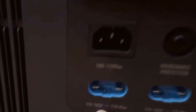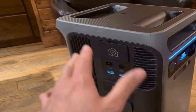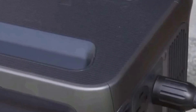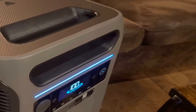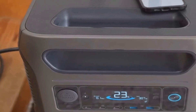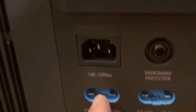What I really like about this is the flexibility. If you need even more capacity, you can connect extra batteries. The base model starts with a chunky 3.84 kWh — that's enough for basic essentials for a day or two, but you can hook up more batteries for a huge expandable system. The built-in solar charging is also great. Anker's panel pops open easily, plugs right in, and if the weather's good, it brings in up to 3,200 watts. I managed to get from empty to 80% in around an hour and 15 minutes on AC power, which is plain fast for a battery of this size.